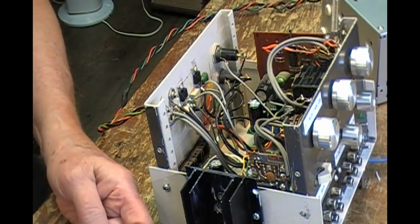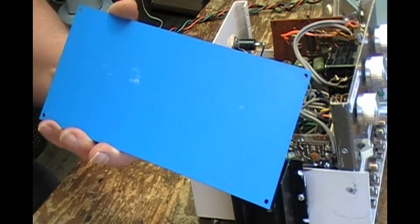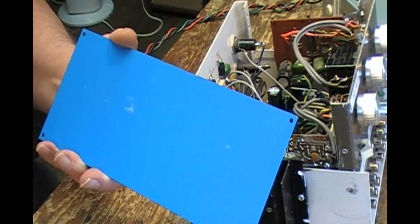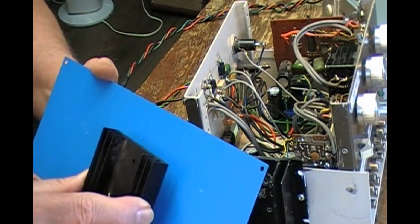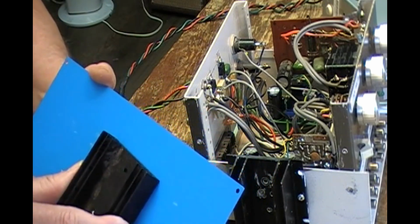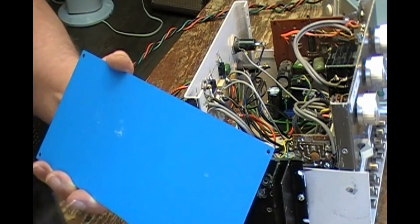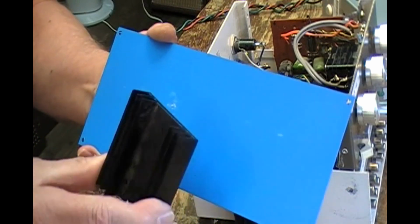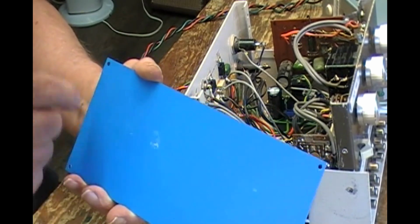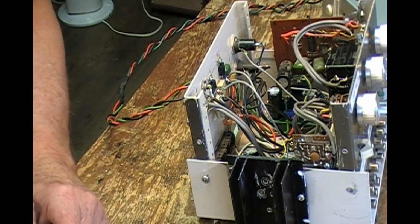There's something that I'm not showing on the panel. This will all be painted, but in order to mount this one here, the paint, I feel, is going to act like an insulator. So I have to take a wire brush on the drill and clean that all off so it's down to bare metal. And then I have to put some painter's tape, the same size, to cover it, so that when everything else is drilled and I paint it, I don't put more paint on this.